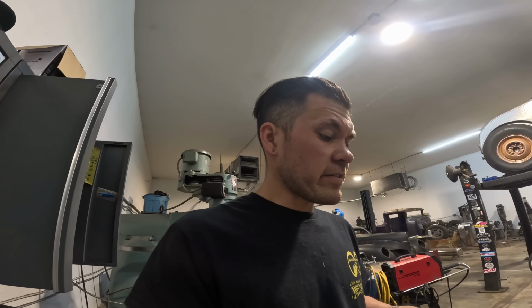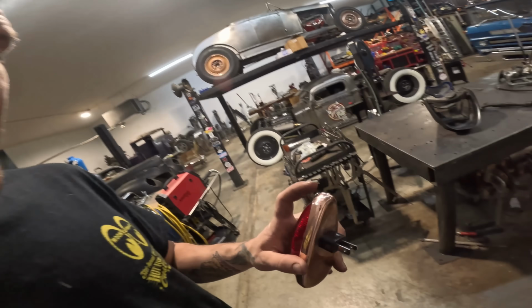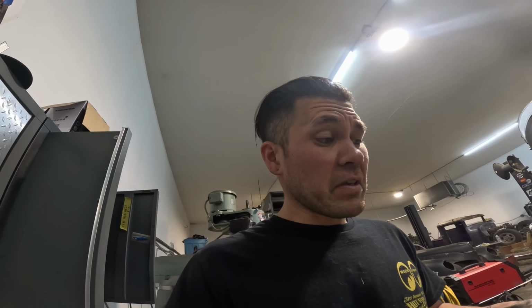I used half inch steel for that hammer form. You probably could have got away with a little bit thinner, but it was nice to have that thickness as well, because you saw I kind of ground right back to that so that I would have a nice flat lip all the way around. Didn't plan it that way, worked out that way. I welded it with copper just from the sheet. Copper welds really nice, especially if it's very clean.